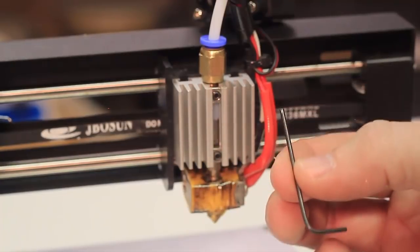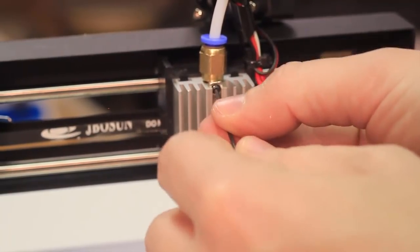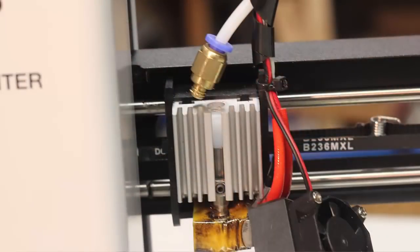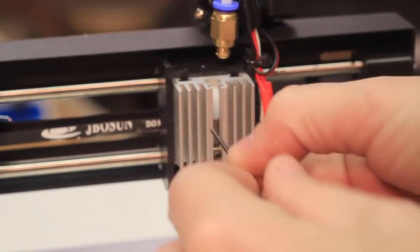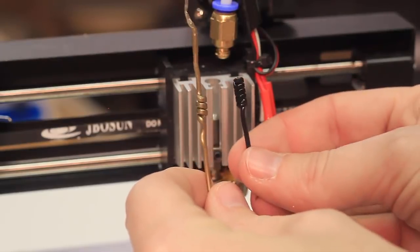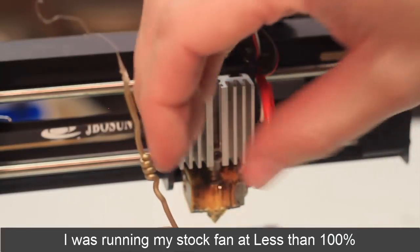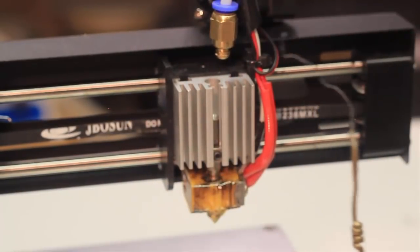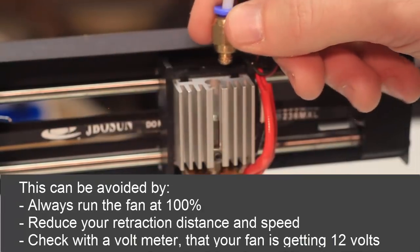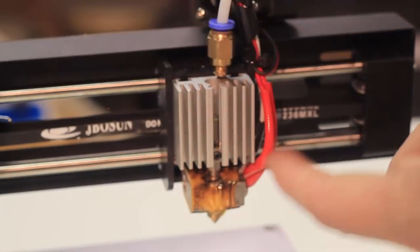What you need is the tiniest little allen wrench you can find — not the one that comes with your printer, that's bigger. You're going to loosen up this little allen bolt on the front and lift this nut off. That frees this part up, and when you lift it there will be filament in here — hopefully you can just pull it right off. The clog is often in this white plastic tube. I was getting clogs that looked coiled up and compressed in that tube from all different filaments. I think the heat was traveling up causing the filament to get soft. As this is hot, you need the hot end to be hot so you can still pull the filament up.